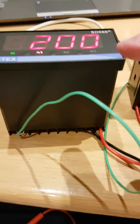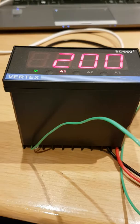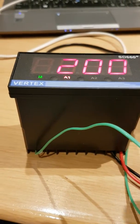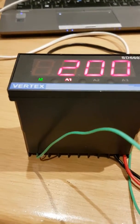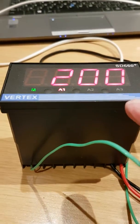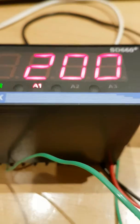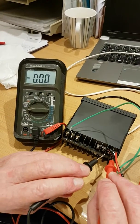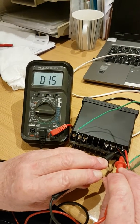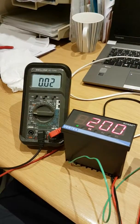I've calibrated the RTSH and RTSL to give me 0 to 10 volts. I've set linear low and linear high at 0 to 200, and low limit and high limit also at 0 to 200. As you can see, I've got a signal of 200 degrees C being injected into this instrument. But the problem is, when I check the voltage, it's 0.15 and it should be 10 volts with 200 degrees C.